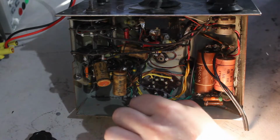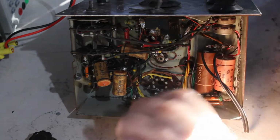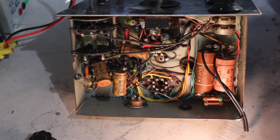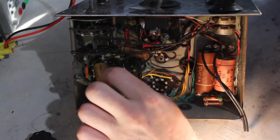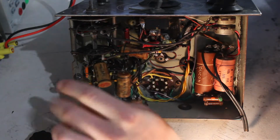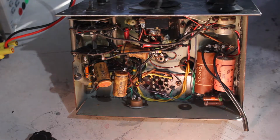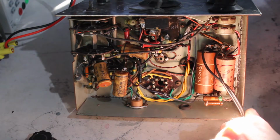And we've got the germanium diode there, which was not in the original, it's just in the circuit diagram from before. What else can I point out here? There's a bit of a dog's breakfast, as I think I might have said before. What I'd like to do is redo this all very nicely and neatly, so I replace these with plastic type capacitors. There's poly whatever, polyester, polystyrene, poly anything, doesn't matter.